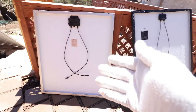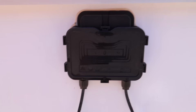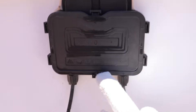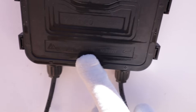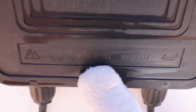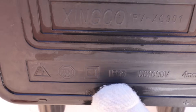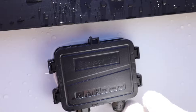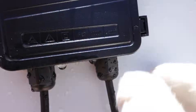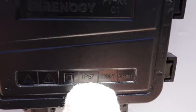There is a difference between the two panels in the level of water resistance. It's going to be difficult to see because it's black on black text, but right above my finger it says IP65 on the generic panel. IP65 doesn't mean you can submerge it. But the Shadow Flux — even though it's a very similar looking junction box — says IP67 right above my finger.